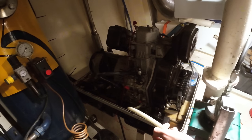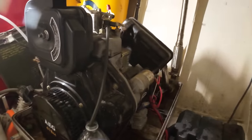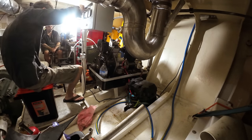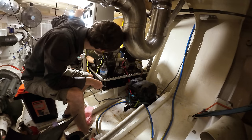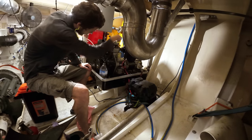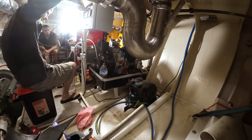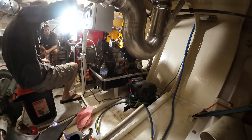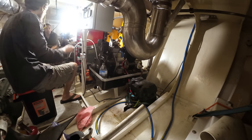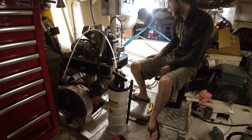While I'm finishing the last of the alloy box mounts, Burke's emptying the oil out of the little genset — it's been run in now so we're putting some new oil in. Our not-so-permanent solution: the guys are using a water bottle for the fuel return line until it can be plumbed back into the non-pressurized fuel supply pipe. Beck's now bleeding the injector line so we can fire this generator up. With the diesel lines cleared, nothing left to do but check it's disconnected from the boat electrically and then start it. You can hear it running a bit rough and pulsing up and down in RPM — it's mainly air in the injector line. As soon as that clears, the engine runs clean.